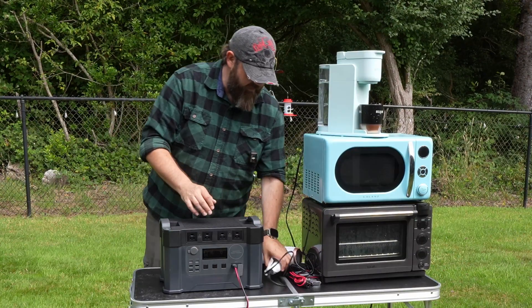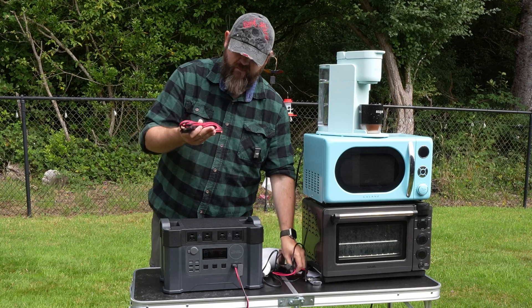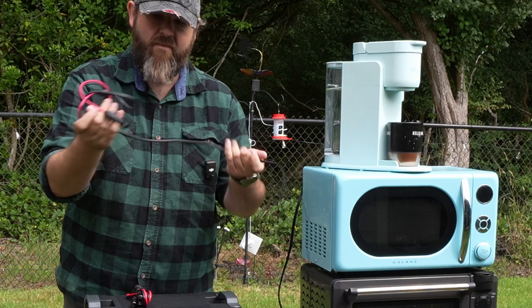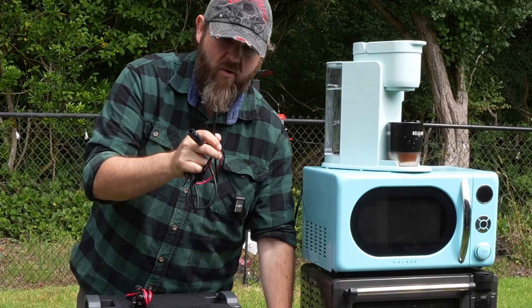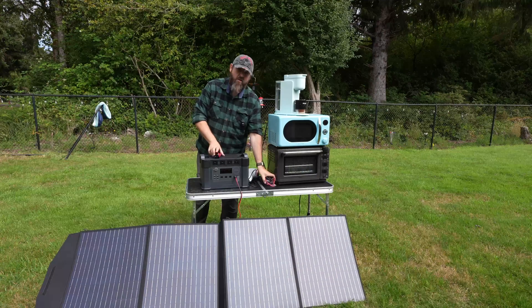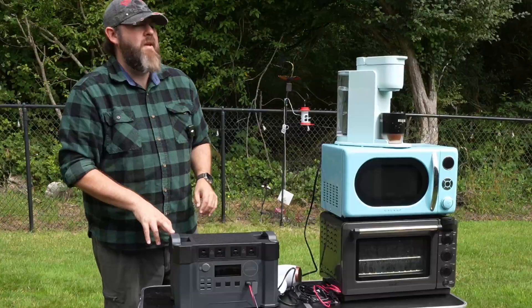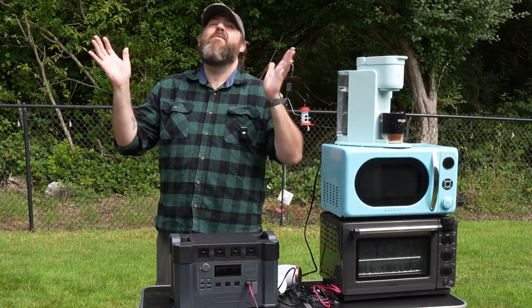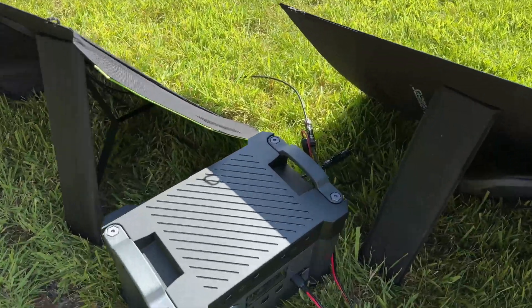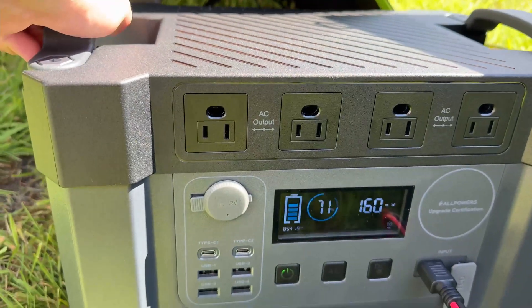Let's talk a bit more about the power station. The solar panels come with adapters — each one has a solar panel adapter — and there is also an adapter for other types of power stations and devices to plug in, plus other tips. The power station also comes with a 12-volt cord. Right now it's really cloudy with no sun whatsoever, but it is still charging at about 70 watts. When I do have full or mostly full sun, I was getting about 150-ish watts.